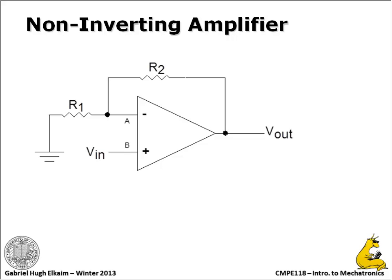All right, so non-inverting configuration, Vn goes here. So this point here is also at Vn. All right, so now again, and this point is at 0. And again, because no current flows in, that I is that I. So again, we're just going to use V equals IR, and I'm going to say 0 minus Vn over R1 is equal to Vn minus V out over R2.